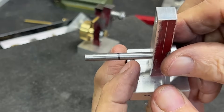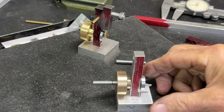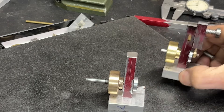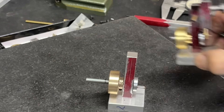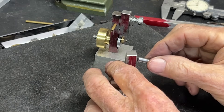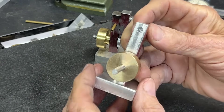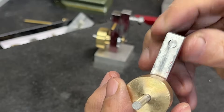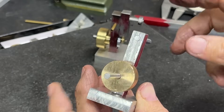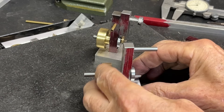I need to cut the main shaft off at that black line because it's way too long. The top shaft that it oscillates or pivots on is also 3/16 steel and it's one and one-fourth inches long. At some point I will Loctite that in. Remember I ran the hole all the way through instead of making it a blind hole — I'll Loctite it in so it is flush with the outside. That's what it looks like so far — a lot of progress.